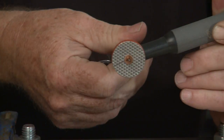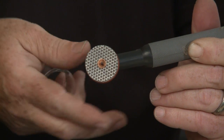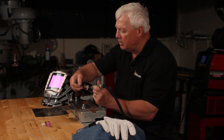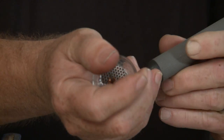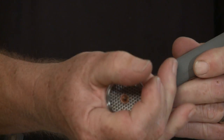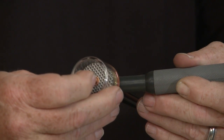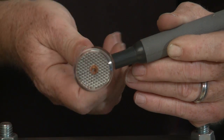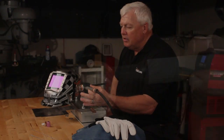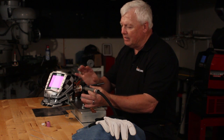Now I'm going to tighten the back cap. Once I do that, the tungsten is in place, but I don't know at this point where I'll need to adjust it. So I'm going to push it back, release it, and make it long. Now this is the hardest part — actually putting on this big Pyrex jumbo cup. You can see through it, and it will handle the heat real well. I'm going to put about a 3/8 stick out. This setup you can do with any torch as well, so we can do some intermediate thicknesses of titanium.